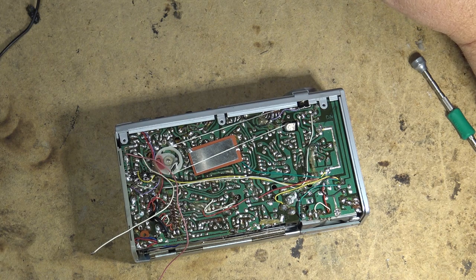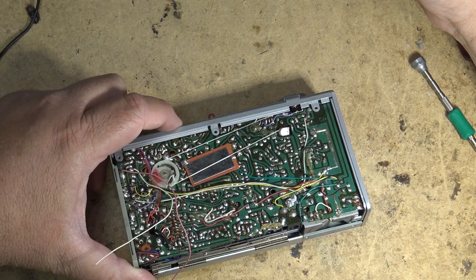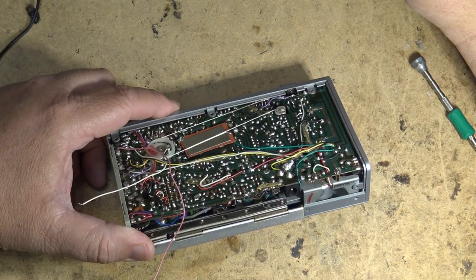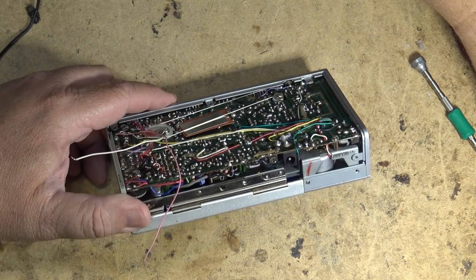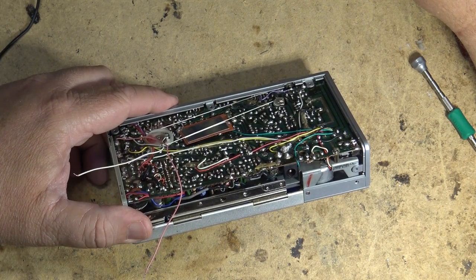If you put Rubber Renew on a belt, you're going to probably melt the belt, and then the belt is going to be shot. But it's kind of like Rubber Renew. It just makes the belt a little tacky. You could probably get similar results by dressing it with some rosin. The problem is rosin is really sticky, and it can end up causing the belt to stick to the pulley. But it's similar. It's kind of a bit sticky like the liquid rosin, but it smells like xylene, and I don't know what's in it. I couldn't tell you what's in it. I don't use it very often, but sometimes you have to.